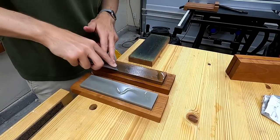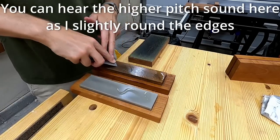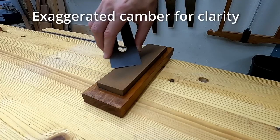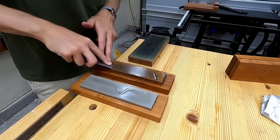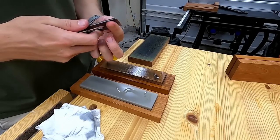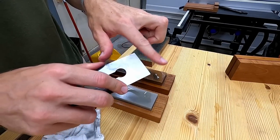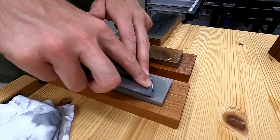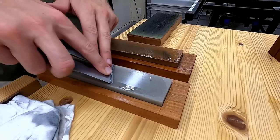It's going to be a little bit hard to notice, but I am going to round off the edges of the blade, which adds what's called a camber to the iron. The goal here is to keep the secondary bevel thin and manageable, not to sharpen all the way down to the cutting edge, which would create a burr of metal that rolls over the very edge. I don't feel a burr and that's just fine. Next I spread the oil around on my honing stone, find the primary bevel, go up just a little bit steeper, and sharpen that secondary bevel.